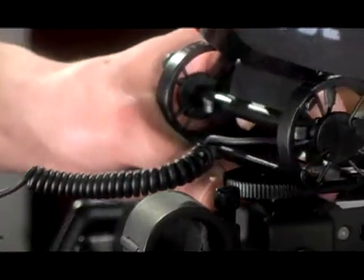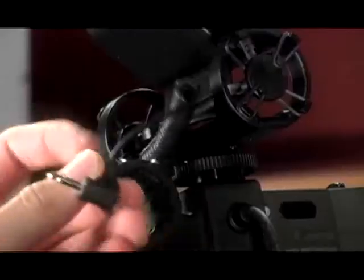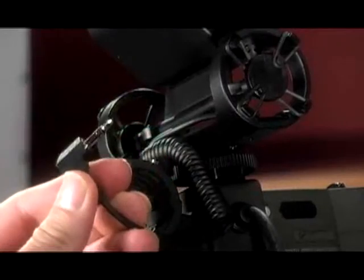Now when you're using XLR you can actually go for longer runs. We could go 20 feet no problem and we're not going to pick up any hum or buzz. I've actually got this mic on right now on a 20-foot extension cable, and I do hear some hum and buzz. When you've got it mounted on your camera you've got about a 6-inch, maybe 10 at the most, coiled cable, and that one's going to work great. That's what we call Hi-Z, and Hi-Z is only good for short runs — that's the little mini plug. So this little guy has a 3.5 headphone-style mini plug input for these consumer type cameras.